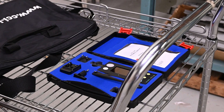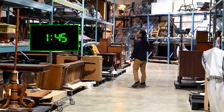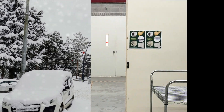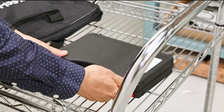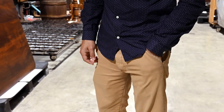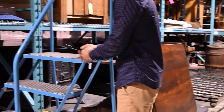This will ensure accurate measurements. When you've moved the monitor from a space with similar conditions, you may only need to wait one or two minutes. But when moving the monitor from a space with very different conditions, such as from a cold vehicle to a heated indoor space, you may need to wait as long as 10 minutes. If you've carried the monitor in your pocket, allow time for the sensor to acclimatize from your body temperature to the ambient conditions in the room.